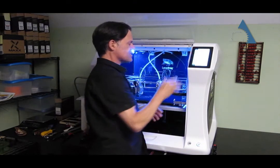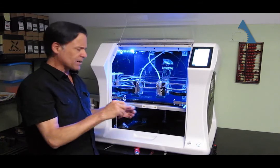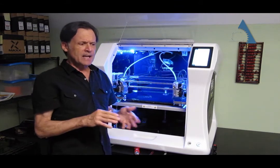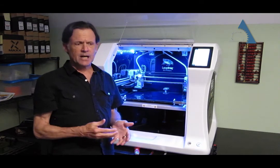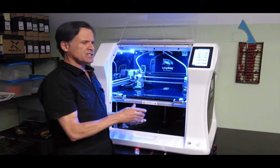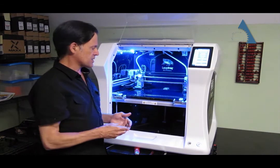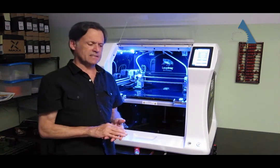If there's still some plastic on there that you can't get off with the brush or maybe even a little screwdriver, the next step would be to purge the nozzles. When you purge the nozzles, the nozzles are heated up and they extrude a little bit of plastic, but then the nozzle's hot. Immediately after the purge, go back into your menu and bring the nozzle back out into the maintenance location, and you'll be able to get that plastic off with the brush very nicely, ending up with a nice clean nozzle.